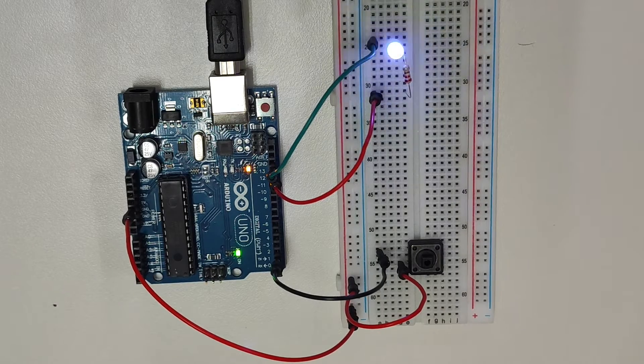So what is a floating pin? The floating pin problem is caused by digital pin number 2, where the black wire connects from the breadboard to the Arduino. When the button is not pressed, digital pin number 2 isn't actually connected to anything. This means the pin is free to pick up on any nearby electrical interference, which will cause the pin to read high and low signals randomly, causing the LED to turn on and off.